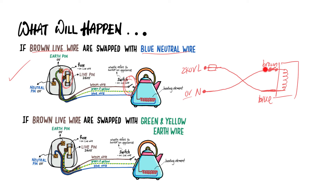This whole wire, even though it's brown, the switch is basically on the real neutral wire, which is at 0 volts. So basically, if there's no other electrical fault, you can use these appliances even though the two wires are swapped — you won't even realize. But the problem arises if this wire, the one that's really at 240 volts — even though it's blue — has some damaged insulation and the live frayed wire touches the metal casing.